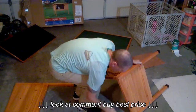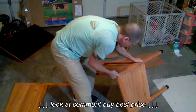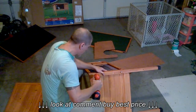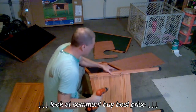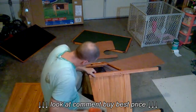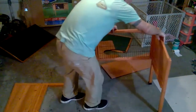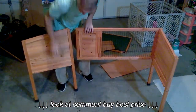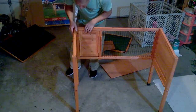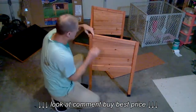We can use those screws — there's already a hole there so I'm just going to set them up and drill them in. This is cedar, so you want to make sure you don't tighten it too much because it can crack the wood — just snug it first. That seems pretty good. See, this is where the tray goes, so that's the inside part. These dowels won't line up if you don't do that. Same deal on this side.